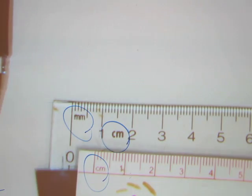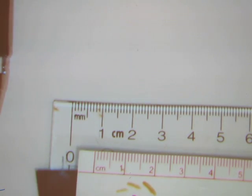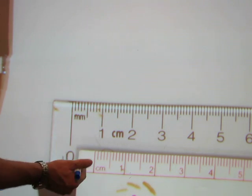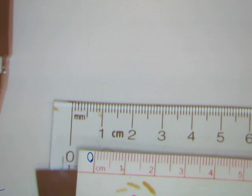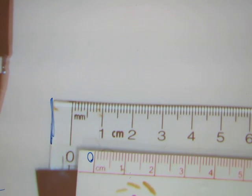That's one centimeter, two centimeters, three centimeters, four centimeters, and so on. Another thing to note is that zero starts here. This tape doesn't have a zero imprinted, but there is an invisible zero there. Measurements start from the zero — not from the edge of the ruler. If you have a tape measure with a hook end, it's not so much of an issue.